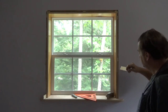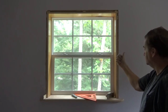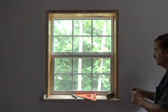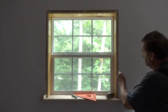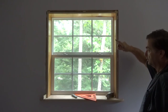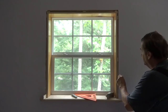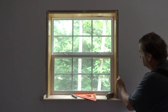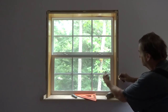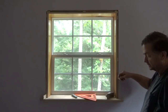However, if the board is touching, like let's say this board was touching back there and the framing member's in there crooked, there's no way you're going to straighten that framing member out. Sometimes you can straighten them out ahead of time if you look at it by hitting them with a hammer hard, but that's not really recommended. But you can still take two shims if you have to, like you see that's loose in there. You can still pull it out a little, make sure there's enough shim in there to nail to, and then put another shim in exactly the same direction.